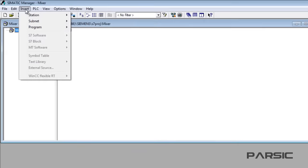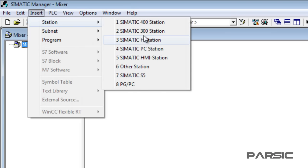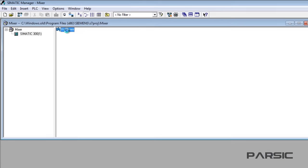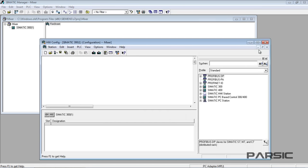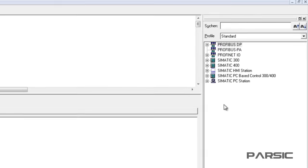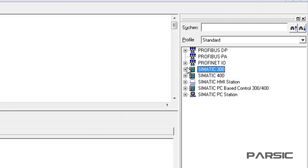From the Insert menu, we select one of the Stations dependent upon the control system that we intend to use. As we discussed previously, we will be using an S7-300 PLC to control our machine, so we need to select Station 300. After selecting this option, a subgroup named SIMATIC 300 has been added to our project. Next, we click on the hardware icon, which takes us to the hardware configuration so that we can configure the modules we need for the PLC. Our PLC is an S7-300, so we need to select the relevant modules from SIMATIC 300's subgroup.